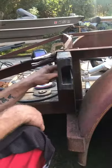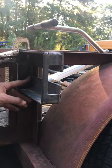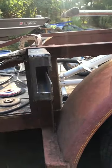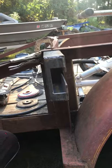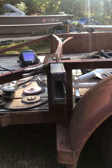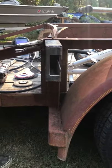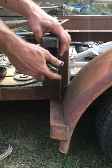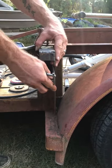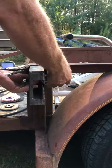This is good enough — hit this with a weld back in the corner and then right here in this corner, that should hold it tight. Then I'll run a bead straight across the top and catch this corner too. About not cleaning the metal — porosity is when you got a lot of contaminants in your weld, it makes it weak like a sponge with air pockets. You want something solid. You don't want one surface clean and one covered in mud.